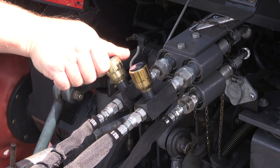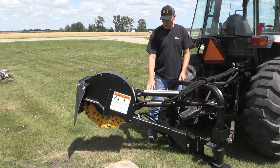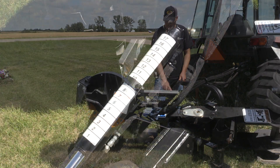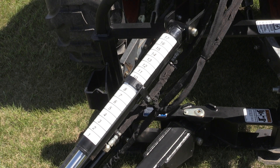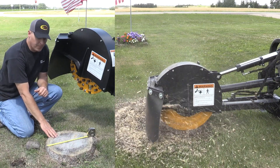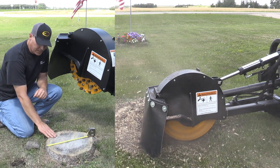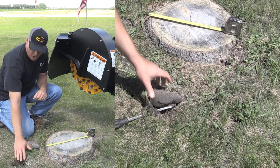The swing circuit has dual needle valves which allow you to adjust the swing speed. The raising and lowering cylinder has a nice gauge on it to give you an idea of how deep you're cutting. The first stump we're going to try today is a pine stump of approximately 16-inch diameter. It's about four inches above grade, and I noticed as soon as we set up that we had a rock right here.